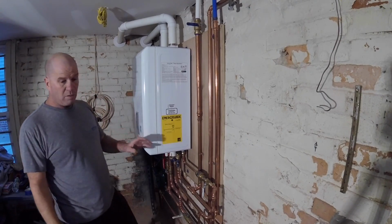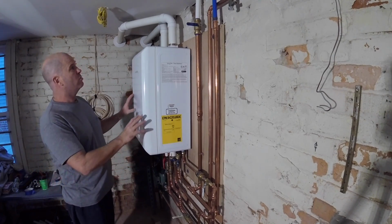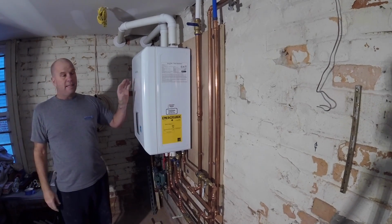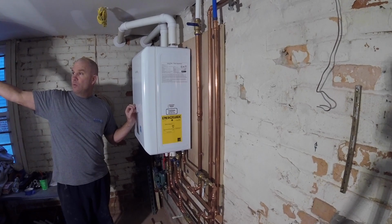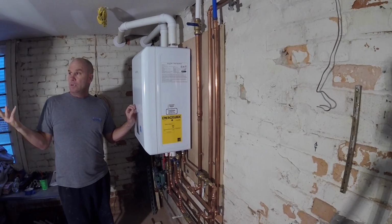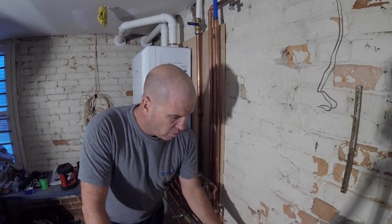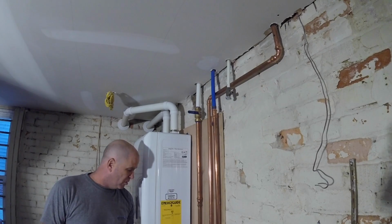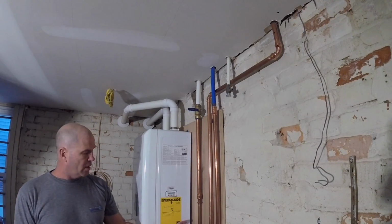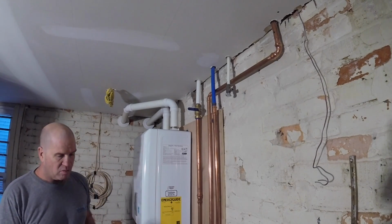Our combo boiler CB. This has domestic hot water and the heat, of course. On the newer Naviens, they come with water heater only, which you can buy an additional circulating pump for, which will eliminate wasting cold water to wait for your hot water to get there. Since we're doing the combo boiler, they don't come with that. So we're going to add a circulating pump to recirculate the hot water on a prefab line that we already installed. The way we're going to do that is tie it in with a cold check valve. This way you'll get instant hot at the sink, the furthest fixture, which this place isn't that big, but George wanted it, so we're putting it in.